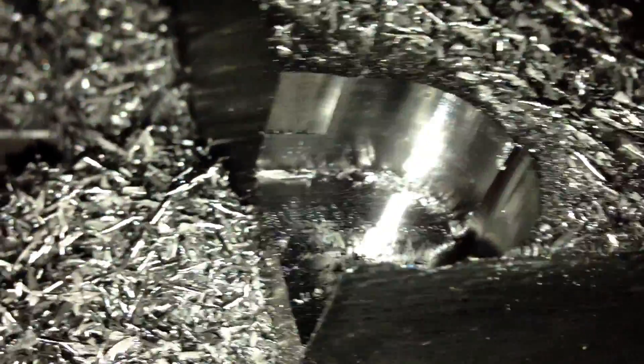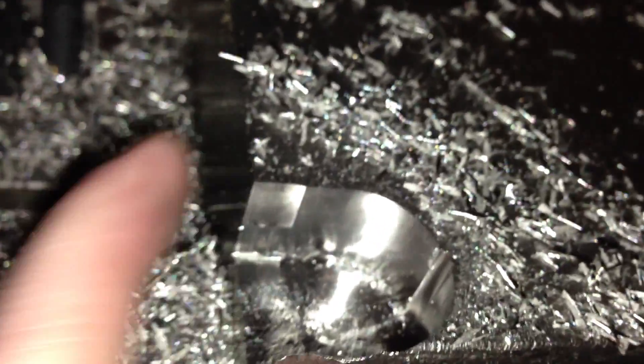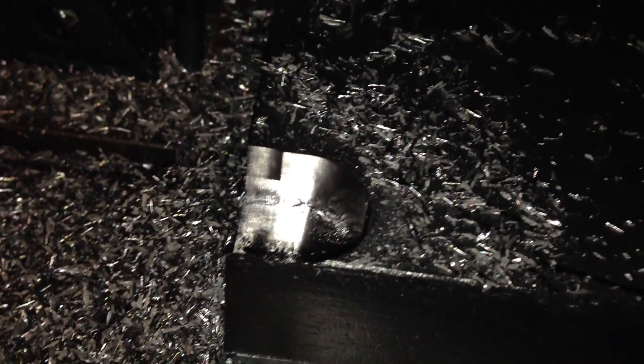After the process, the end mill was cool to the touch and still feels razor sharp — I don't think I did much damage, and it looks just like brand new, maybe a little bit of wear. The surface finish is pretty good overall. There's a small mistake where my screen saver came on on my CAM machine and I had to restart, so I didn't get the exact zero — but since this is just a cutout for a clamp, it's not a big deal. The other mark is intentional — that's the end of the spiral path from CAM-BAM. Titanium's not so impossible after all.